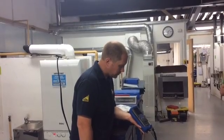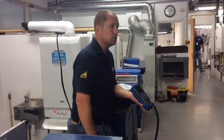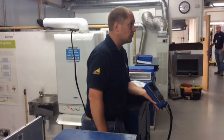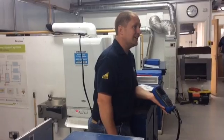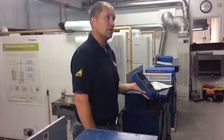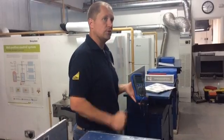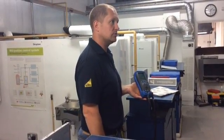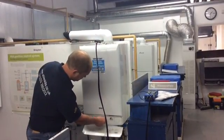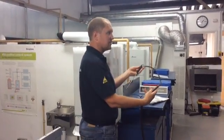There we go. I've got 24-25 parts per million CO, well under the limit. And I've got a ratio of 0.0002, so it's well under our 0.004. That's performing exactly how I would expect it to perform and we have met the commissioning procedure. We can print that off if we want to and record it onto any paperwork we need. So I'm going to turn the boiler off, remove the probe, and let that clear out and settle back down.